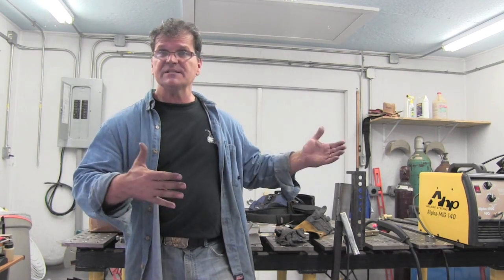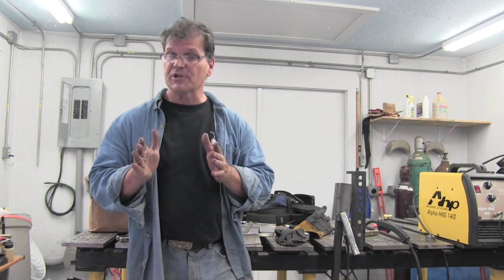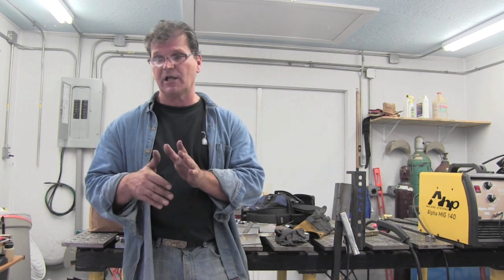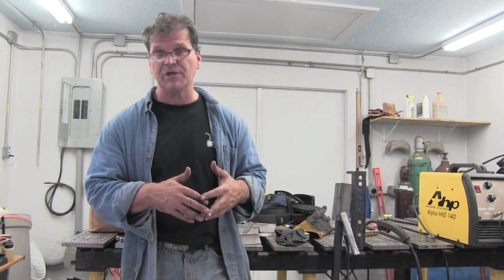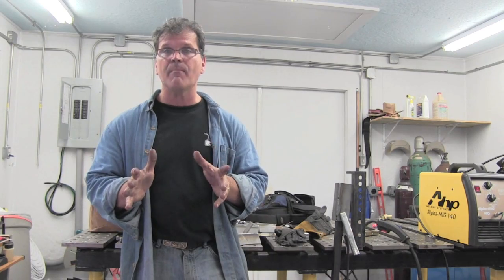Another thing is the wire feeder mechanism. The Everlast is a little more substantial — cast aluminum with a metal arm. The AHP has a plastic wire feed mechanism, though that's not necessarily bad; I've got a Hobart 210 MVP that welds like a champ and also has a plastic wire feed mechanism. So the arc is different: transformer versus inverter. The main thing is the inverter definitely had more power at max amperage — I didn't even get close to max settings on it with .030 wire welding quarter-inch steel and it was hot. You're going to get more juice out of an inverter — that's what they do. Just remember: if you're in the market for a 115-volt MIG, make sure you've got a 20-amp breaker — that's going to be the difference maker no matter what kind you get.